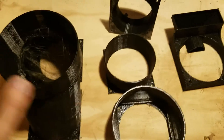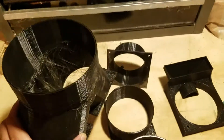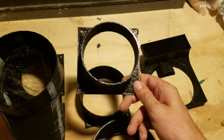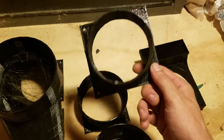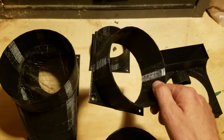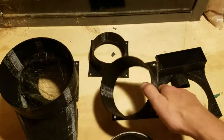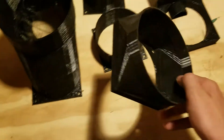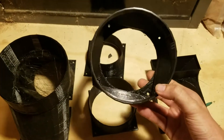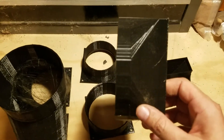This is the six-inch dual — the biggest part I make. That's why you see such a price difference between parts. This part typically weighs about two ounces; you get about 16 parts to a reel, maybe 14 depending on density. This guy you get about 12 to 14 per reel. If you're printing at home, print time is a little slower but you get a better part — about two hours per part. It weighs almost two and a half times as much as a four-inch part, and that's why the price is higher.